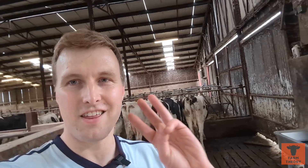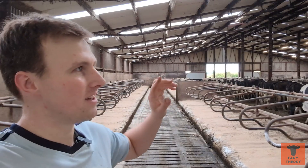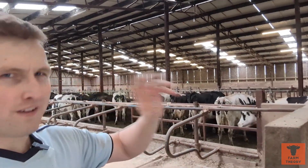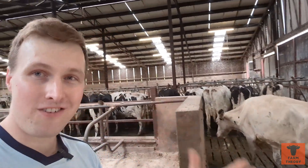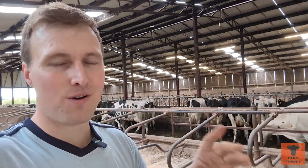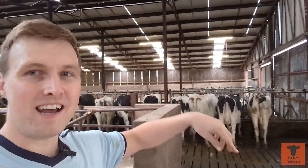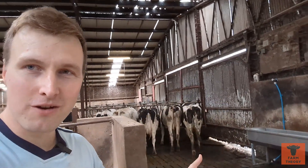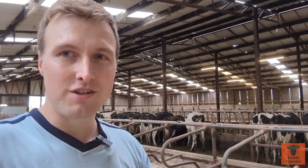There are three of the four drinkers installed. Tomorrow we have a final drinker to install at the far end of the house, and we also have to make a start on all of the pipework. There's 50mm pipe coming from the milking parlour into the shed, which is then going to be broken down into 25mm pipe to feed every drinker. There are tons of solenoid valves and flow meters to go on — we'll be able to tell how much water each individual drinker is taking along with each side of the cow house. The idea is that we can automatically drain a drinker if we detect the cows are not drinking as much as they should, assuming it's dirty. If that doesn't work, we still have the option of shutting off the water supply, draining each individual drinker, refilling it and doing them all in sequence — so I never have to drain them manually.